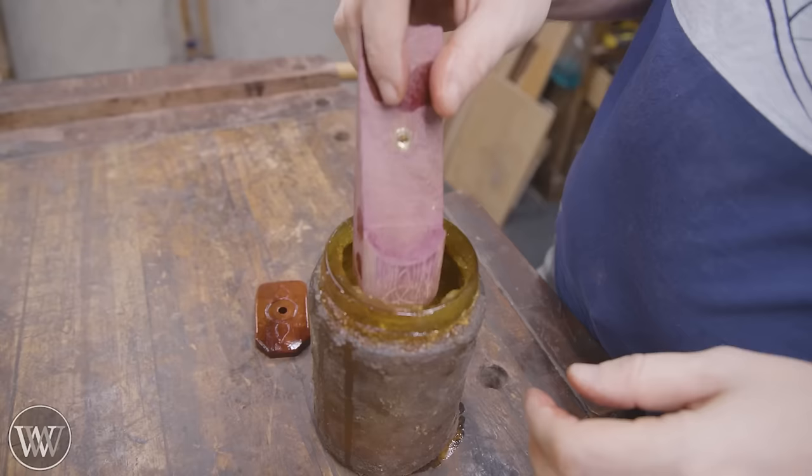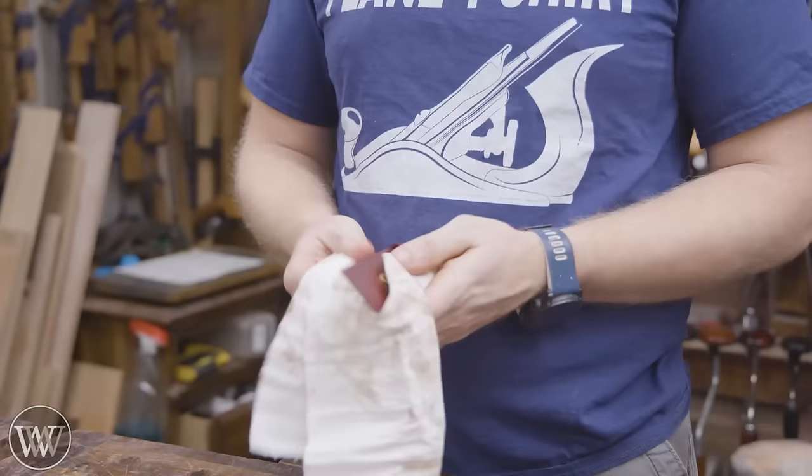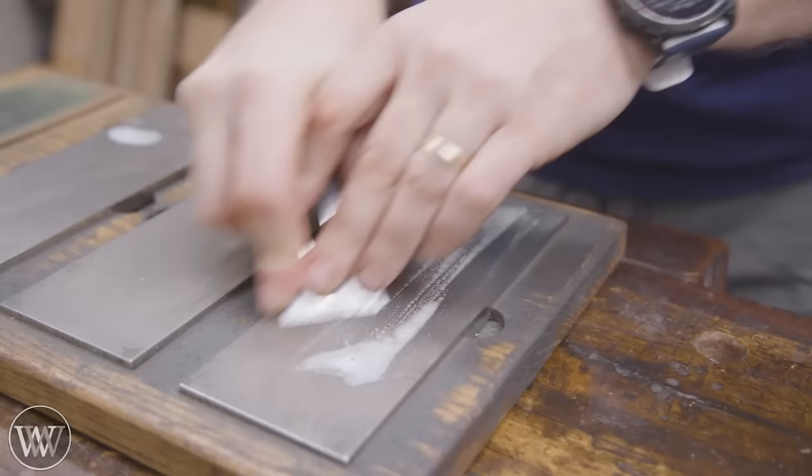After that, of course, boiled linseed oil and paste wax, because nothing feels better in the hand than a simple boiled linseed oil finish. Let it rub out, apply the paste wax, work that in, and once the paste wax is set a little bit, wipe it off. Really quick, very simple finish and very easy to work with.